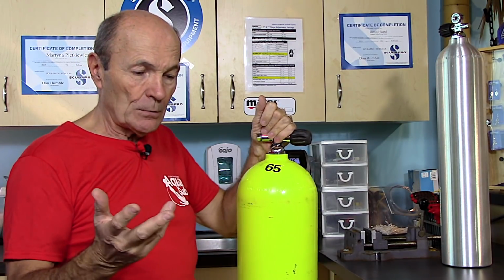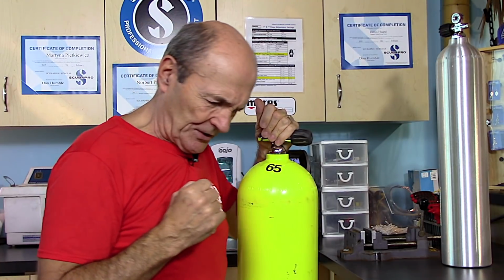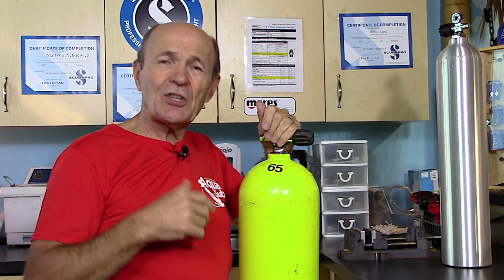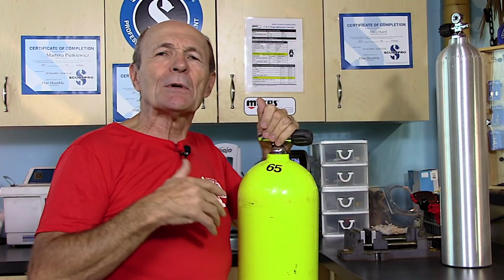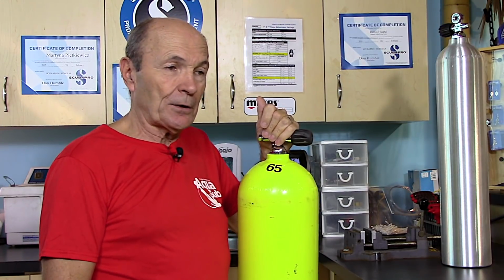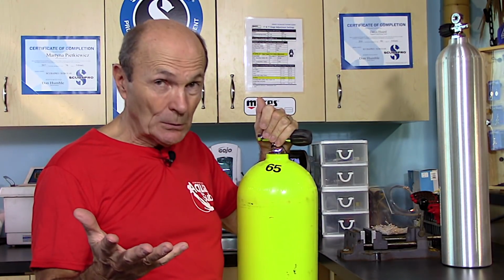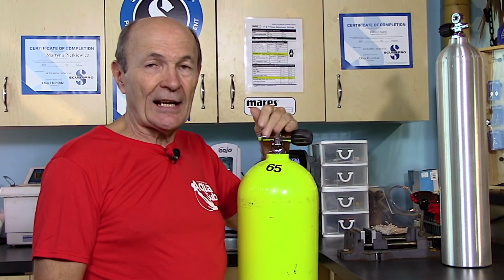Now, if you don't allow them to do that, you run a couple of risks. Number one risk, in order to get a decent fill, it takes time. So if you go into a dive store and you've got 5 minutes to get a fill, you're not going to get a good fill. It'll be 3,000 PSI when he gives it to you, but it won't be 3,000 PSI an hour later,